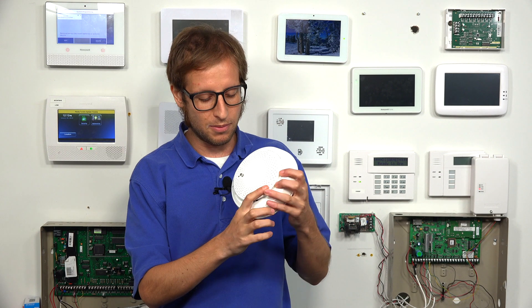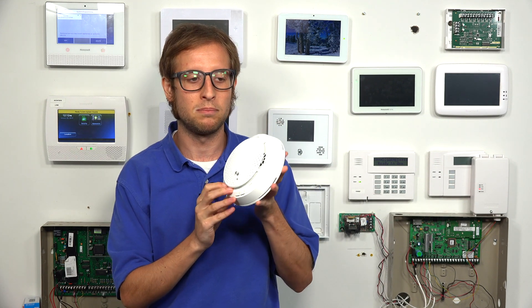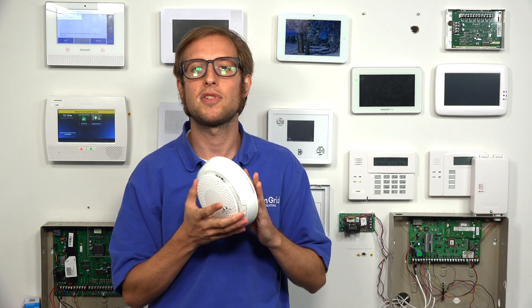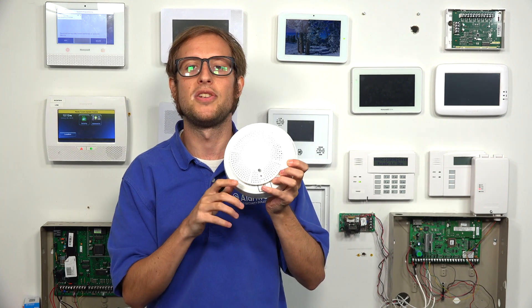As you saw, you get a tamper cover when you open up the sensor. You will get those for any zone programmed with the 6 Combo. Since it does smoke detection, heat detection, and CO detection, you'll get a tamper cover for each of the zones, assuming you have them all enabled. You won't need to open up the sensor to look at the LED light — this green LED is useful for enrolling the sensor. When it's blinking quickly, the sensor is not enrolled with the Lyric system; when it's blinking slowly, it is enrolled. You can check this LED light on the front of the sensor.